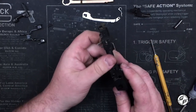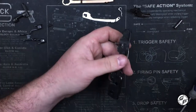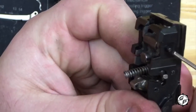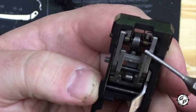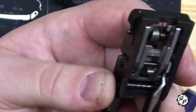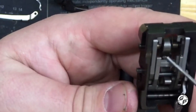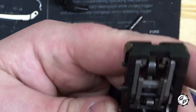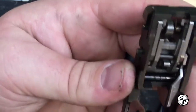Now we're going to get back into the sear housing. The sear housing is a little bit different on this. We're going to need our 1/16th punch. First one you're going to push out is the main camming actions back here. This goes through the actual sear itself. The springs are part of the actuator — the legs or arms, if you will — that hook into the actuators, and then the spring itself seats right here. This is what makes the sear go up and down. You do have another spring under here that keeps tension on the blocker, but it's strictly for the blocker. Without this little spring, nothing's going to work — the sear doesn't work, nothing works.